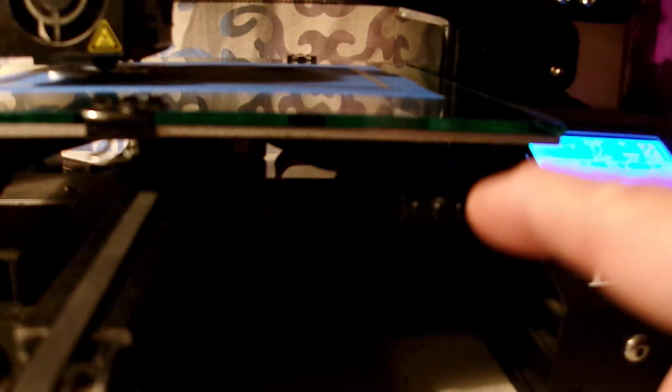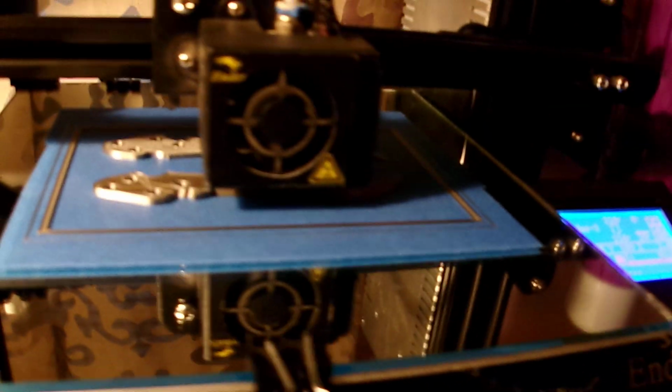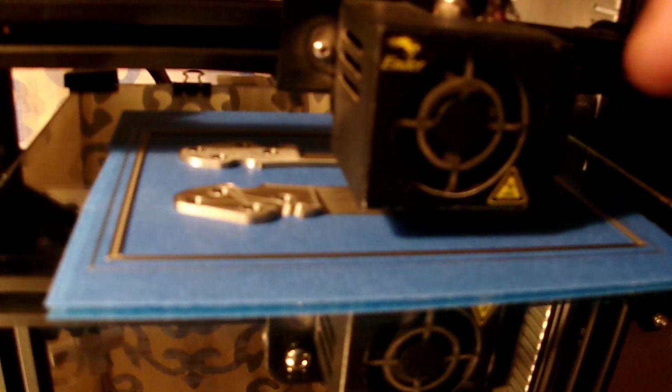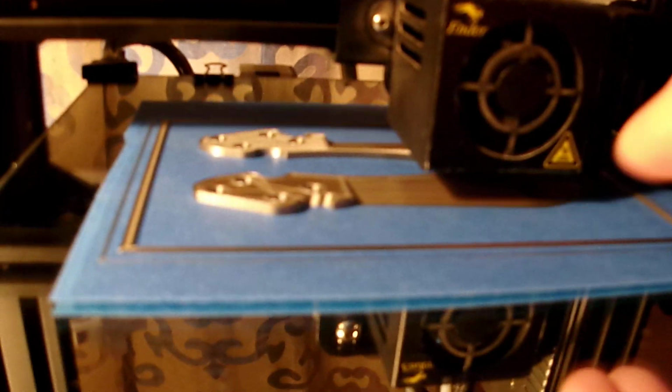Because I have it set up in this fashion and the springs are properly installed. When they're not properly installed, then you have problems with leveling and yada yada yada, and people recommend go to the yellow springs, go to solid chunks of rubber. Well, I didn't want to defeat the safety feature of collapsible springs. The springs are just good enough. It's been designed for this purpose, just good enough to hold it level when it should. And if for whatever reason my fingers are grabbing a piece of filament or pushing something away, it's collapsible. It has just enough elasticity to push away. So again, I don't damage the printer or I don't damage myself.